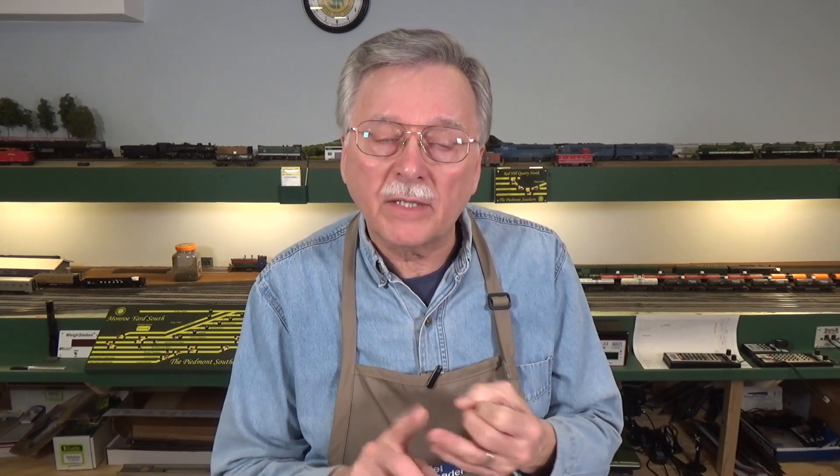As far as a parts list and wiring diagram, I've already gotten a comment from someone wanting the part number for the negative ion generator. I got it off of eBay — there are hundreds of these for sale, most of them coming from China. There are ones with two wires in and two wires out, two wires in and one wire out, and two wires in and lots of wires out. I decided to use the one with two in and two out — red and black, positive and negative — which greatly simplifies everything. All you have to do is search eBay for negative ion generator.